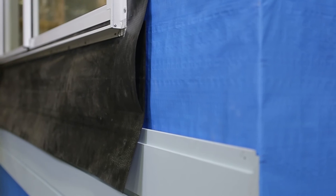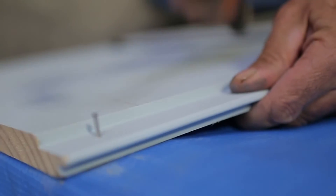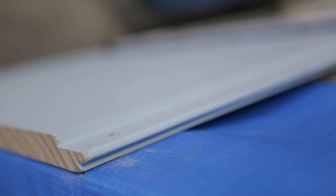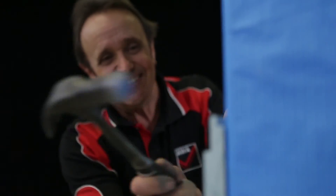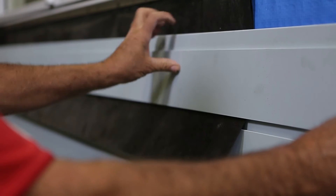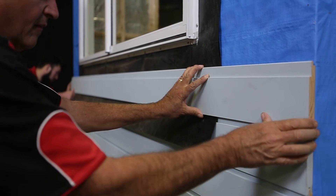There are quite a few different types of cladding used nowadays and each type will need a slightly different approach. The most common variety is a shiplap like we're using here today, vinyl or composite boards, or fiber cement sheeting. You should follow the manufacturer's details for each. Sill flashing should be laid into the cladding joints roughly two rows, or up to 300 millimeters, below the window.